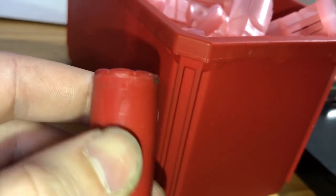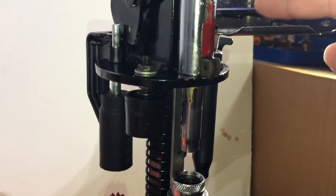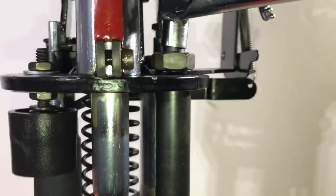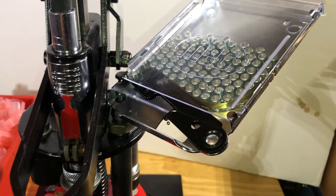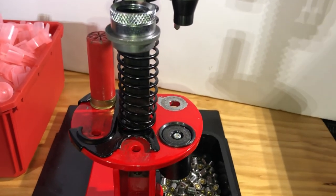You can see the shell has a slight taper on the mouth and all the petals are closed nicely and evenly into the center. If you have the priming system hooked up, there is one other component involved: a tiny lever that comes across and sits on top of the housing. That lever is the actuator that tells the priming system when to drop another primer into the prime station. As you lower the handle for that final crimp, the lever comes down and carries a primer down into the top of the primer tube — it drops in and is now sitting in the base, ready to go for the next shell.